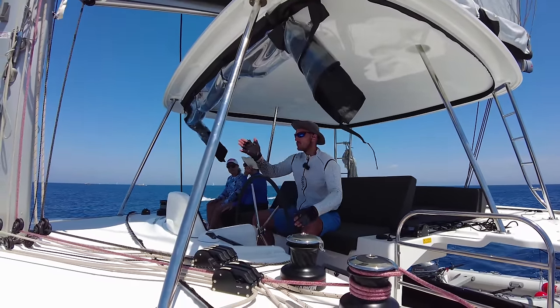On the other hand, that catamaran, the bow gets blown left and right, so it has to adjust the boat much more. And also I have the rudders now facing upwind, so basically my bow is just pushed kind of downwind. And you see, I'm not doing much. And then when I want to correct the boat a little bit, I just put one neutral, keep this one here, and then the boat is slowly going to move here. So basically this is a very good trick, because you're going to use much less work and much less wear and tear on your boat than the catamaran there, because he has to use it much more. See, his bow just gets blown off, but because we're facing reverse to the wind, we have the propellers pulling us upwind and the rudders, so our bow is pushed off wind, which is great, because we want to have it downwind. So it's a very good method.